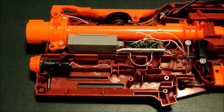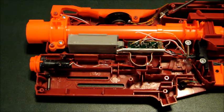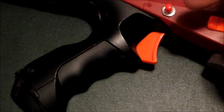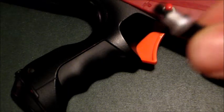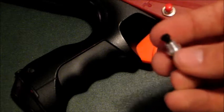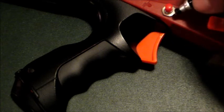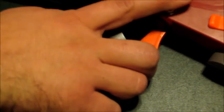I've also managed to install the power switch — I cut a small notch in this portion of the shell so that way this switch can actually peek through there. The reload button is one of the few changes I had to make to the outside of the blaster. It's located just above the trigger so it's easy to access when you're firing. This is just a simple button you can pick up from Radio Shack. All you do is solder the wires on the two connections on the back, drill a hole where you want the button to come through, and slide it on through. There's a washer that goes around the outside that you screw onto the top to secure it in place.